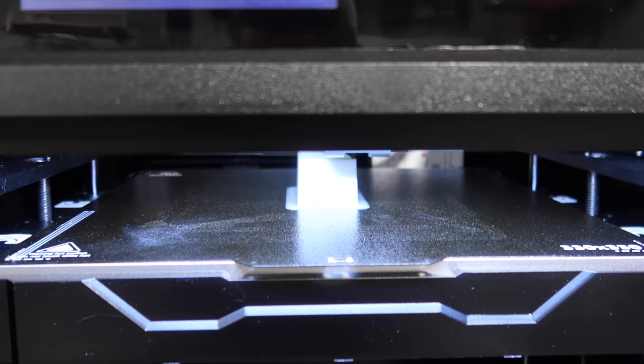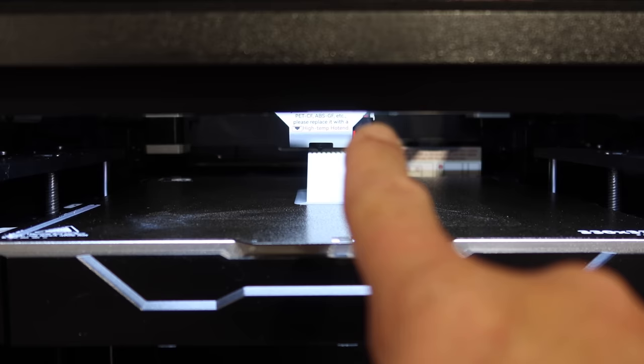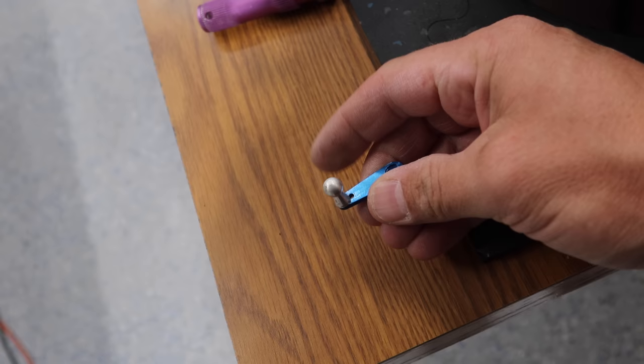We're making some good progress on the 3D printer. If you look closely you can see we've got a bit of an angle coming to the top — the base is 40 millimeters, and when done printing the top will be 35 millimeters, so it's got just a slight angle to each side. For the servo arm, I took the screw off the back and double checked it — I wanted to make sure they used Loctite. They did use Loctite, but we will check them on the other surfaces.